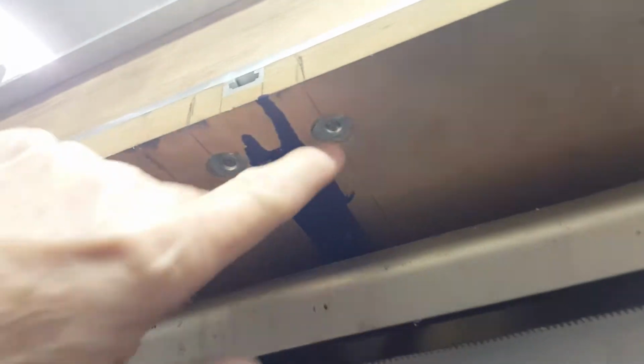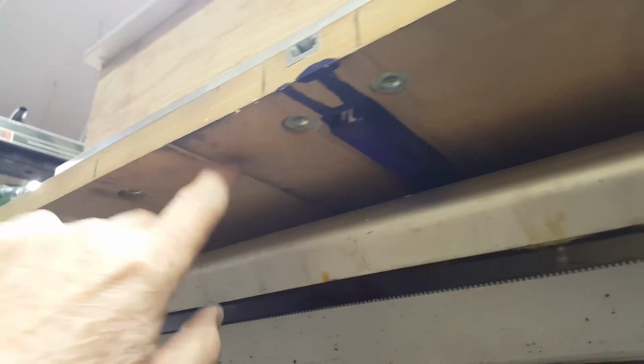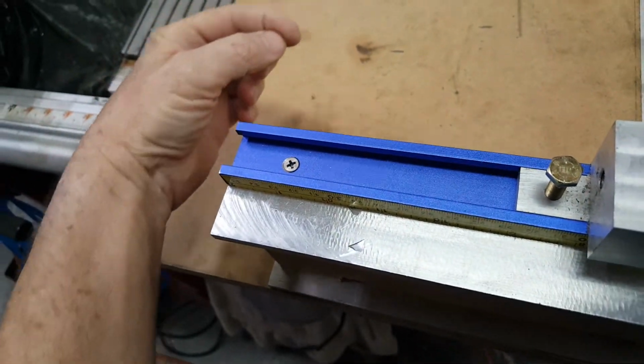So what I did, there's a screw right here. Now this is MDF and it's all cut, and these are threaded inserts that are in it that you can screw into from the top. Okay, so inside each of these little slots, there's a screw, and there's one of these guys underneath. Now, these are slotted slightly. I think they got like a 1/4 inch slot back and forth. So you loosen all of these across here, leave this one secure, loosen all of these, and this thing you can move this way or that way just a little, and enough to dial the thing in.